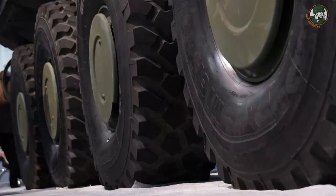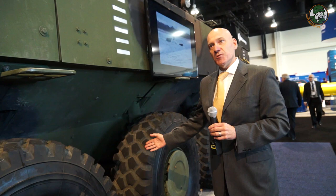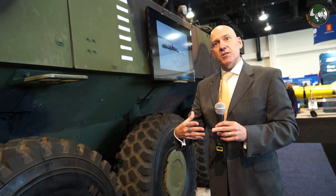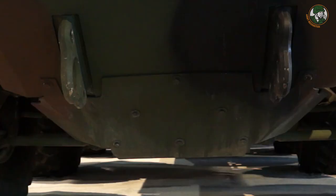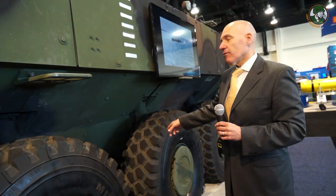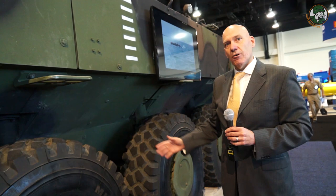You'll see the eight wheels — four on each side. With the H drive, this vehicle has no axles. Each wheel is attached to a drive box, and each drive box is driven by a drive shaft. This increases mobility in soft soil environments and tractive effort similar to a tracked vehicle. There are three drive shafts on port and starboard sides, linked to a transfer box located in the middle of the vehicle, roughly in the first third.